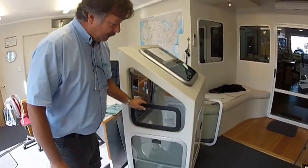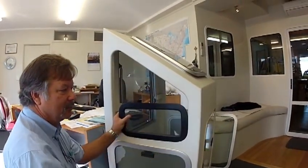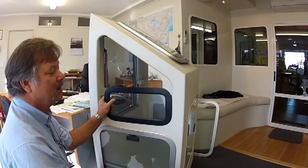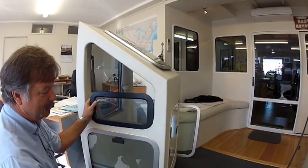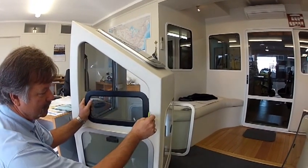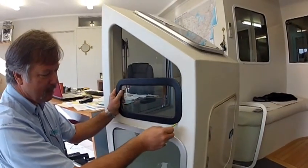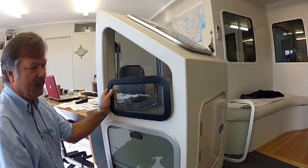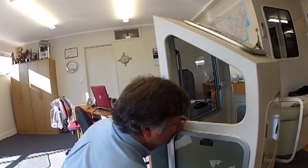Pretending that is the hole in your boat, you fit your window. If there are any lumps or discrepancies in the aperture, you file those out, sand, and do whatever is required so that you have a nice loose fit. You want one or one and a half millimeters of clearance. Once it's where it wants to be, you pack it, then mark around the window flange on the outside of the boat and remove the window.